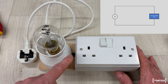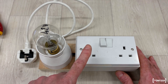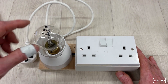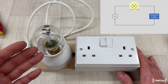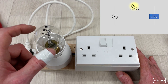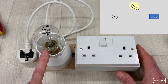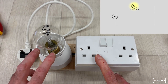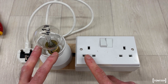It conducts more or less 100% of the current and you get full voltage and whatever wattage you require at the sockets. The moment you have a short, or the moment you draw more than 42 watts, the filament inside the light bulb will warm up and eventually produce light. The light bulb is designed to draw maximum 42 watts, so it now acts as a current limiter — meaning even if you short the two conductors, you won't have more than 42 watts flowing into the whole circuit, so your device under test won't receive more than 42 watts even if it shorts out.